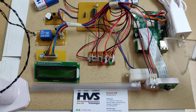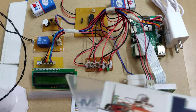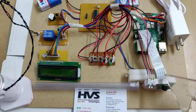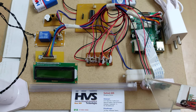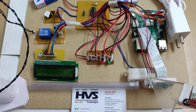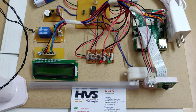All components are interfaced to the Raspberry Pi 3 B+ model. The mist maker is controlled through an electromagnetic relay. The steps are: initially it will scan the temperature, and whenever the temperature is under 100.8 degrees Fahrenheit, it will proceed to stage 2.